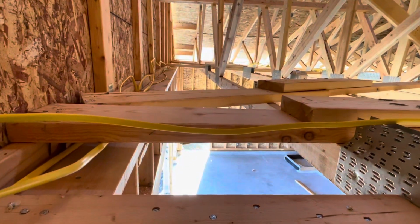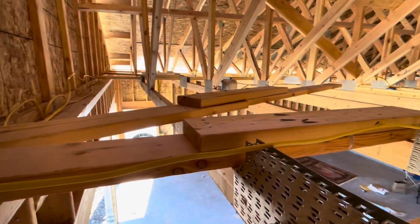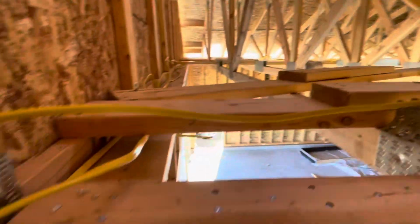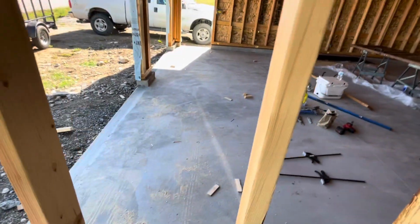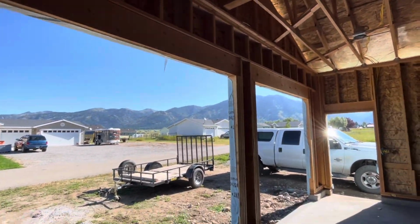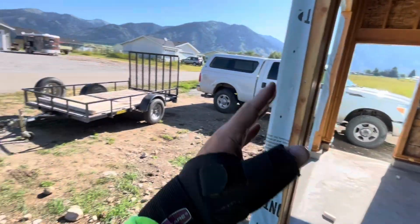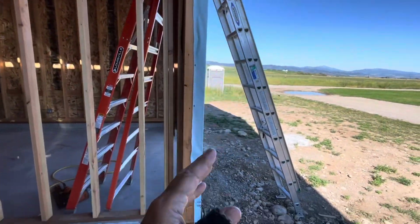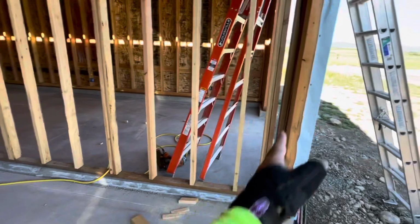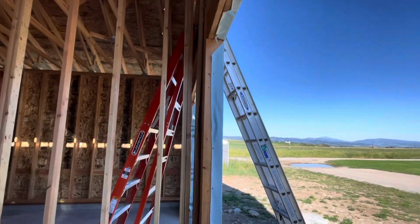Inserting another framing segment here. You can see some scabs in there on our rat runs and a patched together wall here that I put back together. I don't know that I ever mentioned it on a video, but I came out a couple weeks ago and found that when I was checking for garage door measurements, these two middle posts were out about 1.5 inches. I had to frame that wall that day, so I did, and as I framed it, it just wandered out a full 1.5 inches going up.